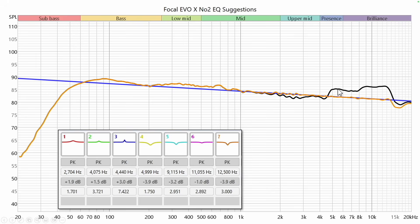If I apply some equalization I came up with in REW, you can see I take the black line — the estimated in-room response on axis — and bring it down to this orange line. I also bump up the black line about a decibel to flatten the overall in-room response. This is what I used to make the speaker sound more neutral in the room. However, when I did this, it took a good bit of the liveliness away from the top end. If you like that characteristic, keep that in mind when you start EQing.